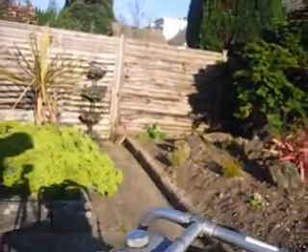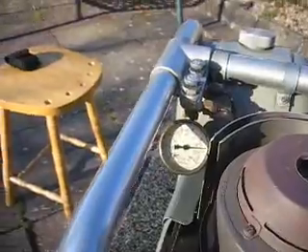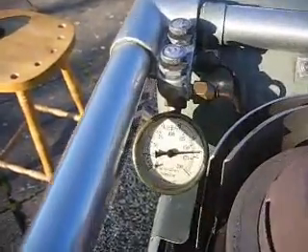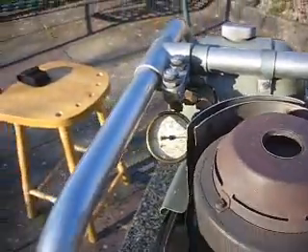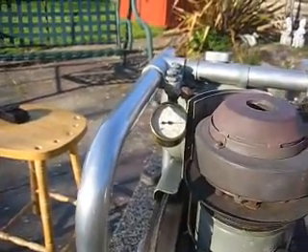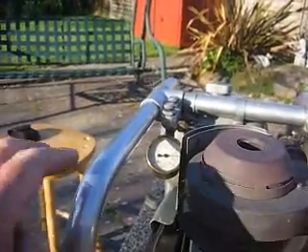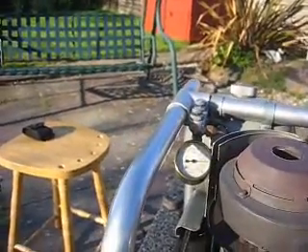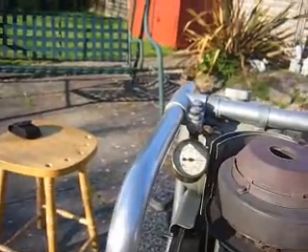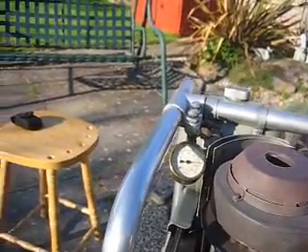You will see there that the engine is being pumped up now to approximately 165 psi. The manufacturer's handbook recommends that you pump these right up to 200 pounds per square inch. All ready for the next start, but it can be a bit of a struggle to get that 200 pounds.